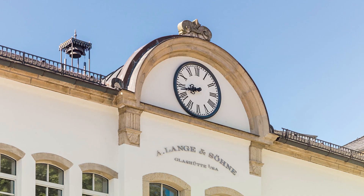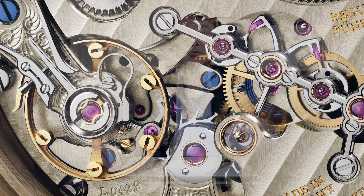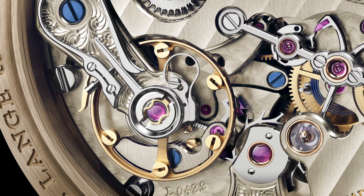To move these discs, you need a lot of energy. So you have a strong mainspring — but that mainspring, used to move the disc, was way too strong to power the escapement. The inspiration for the solution we found here in the Stammhaus, the main building, because there we still have the master clock: a large pendulum equipped with a remontoire system. We took that inspiration for the watch and built in a remontoire system to balance the huge power towards the escapement. Another advantage is that the remontoire system defines the moment of jump — in this case, after every 60 seconds.